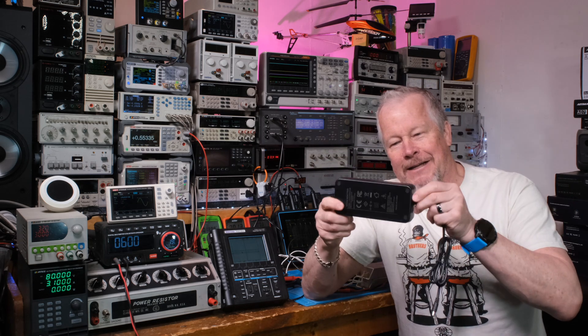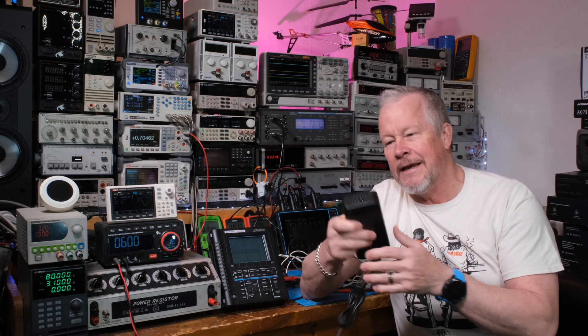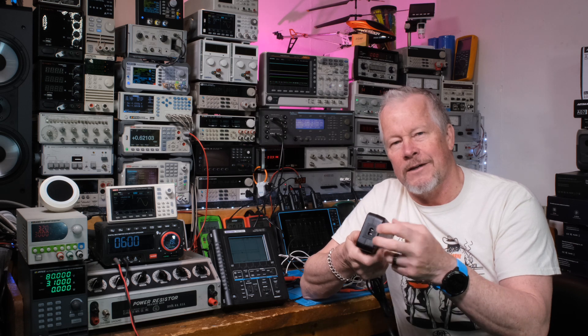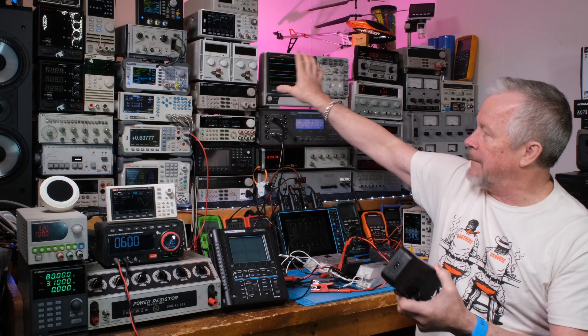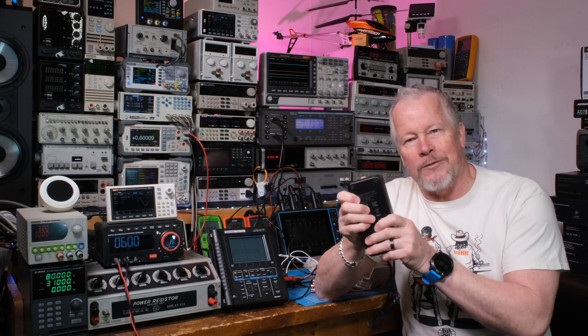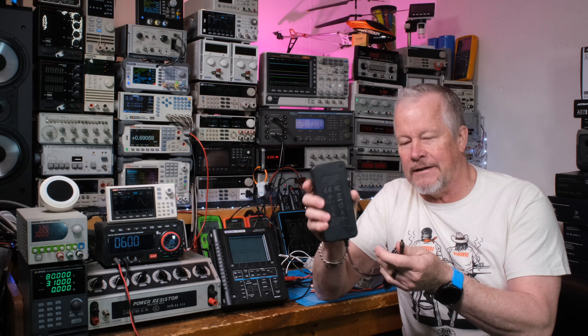It's actually longer than the amplifier. We have the AC power coming in here — it's just two pins. You don't have ground coming in because it's a plastic case, so we don't need the ground. The chassis ground ties all the metal parts together so they're all safe, but when you're dealing with plastic, we don't have to worry about getting shocked touching it. So you don't need the ground chassis on this.